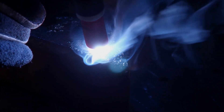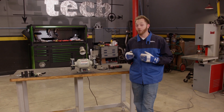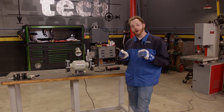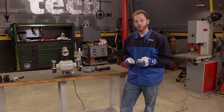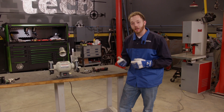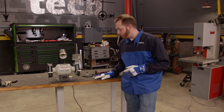The tungsten is getting dirty. One of the more difficult parts of TIG welding is keeping your tungsten electrode clean. You can be welding along and hit a little pocket of rust, oil or any other contamination, and the molten puddle can actually bubble up and stick to the tungsten electrode. When that happens, it's best to stop welding and sharpen your tungsten.